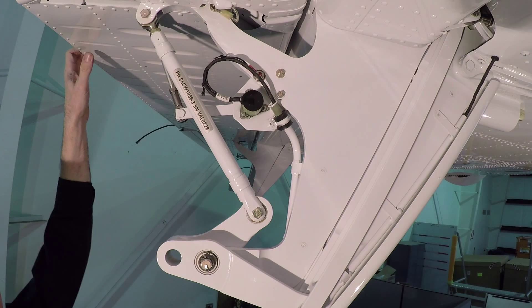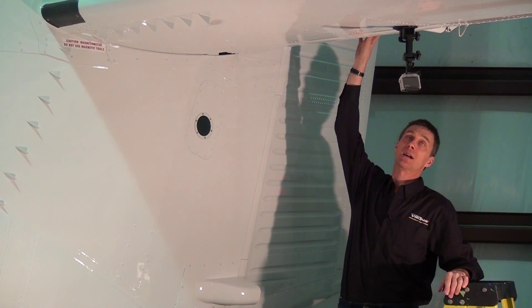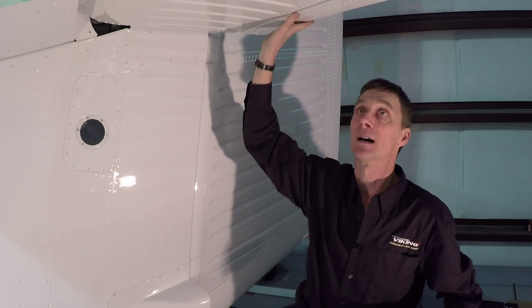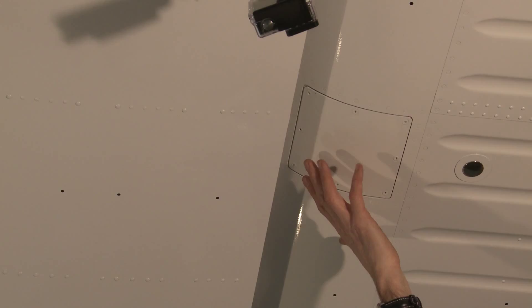These positions are displayed on the cockpit screens. We're having a look at the tail of the Twin Otter, looking at the flight controls here — cable-operated flight control mechanisms. Inside the inspection window here is the elevator bell crank assembly, with a cable-operated elevator trim tab through a jack assembly located here, which extends and retracts to control the tab.